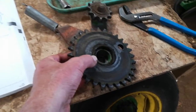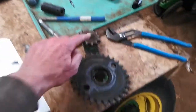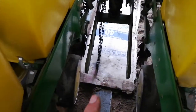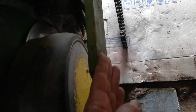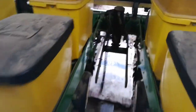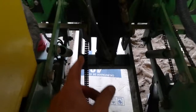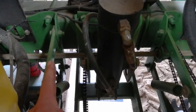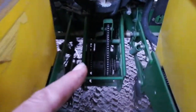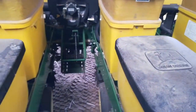I've got one done. The sprocket goes on the shaft, and then the sprocket and the chain tensioner go right here. The shaft goes through with the wheel on it and then the chain hooks around the sprocket and drives the wheel. Those chains drive the octagonal shaft that goes through the whole thing, and that drives essentially your feed rate box — you change the gears and move the chains around to change your seeding rate. It's ground driven, so it controls seeds per acre.